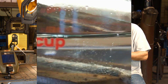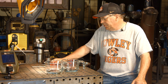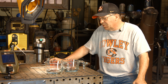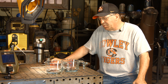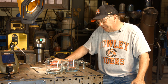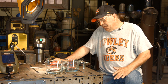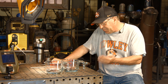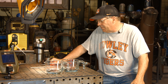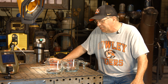We let this sit for a little bit and we've actually got hydrogen bubbles coming off of this thing — you can see them rolling off. We don't have anything over here on the low hydrogen bead at all. We're not proving anything, we're not measuring the amount coming off. It's just an awareness of hydrogen embrittlement — where does it come from? If you're welding on some critical alloys and fittings, you might want to be aware of this. How do you get rid of the hydrogen? Preheat is one — a generous preheat would get rid of a lot of it. With your cellulose rod, you want to do a preheat around some thicker sections, some fittings. There are some codes and standards when you're getting into pipeline work — heat input, wall thickness versus pressures — there are a lot of variables. The whole video was to point out we've got hydrogen boiling off of a cellulose rod, and we don't have anything boiling off of a low hydrogen rod. The students really liked it when it was shown to them — a little awareness thing.